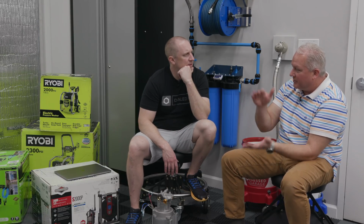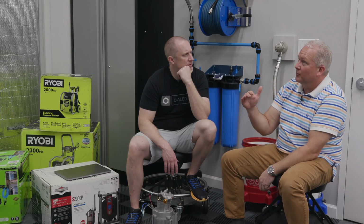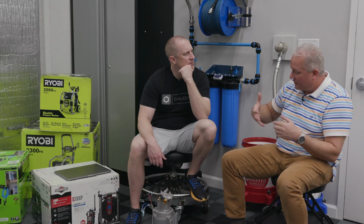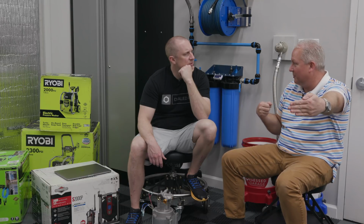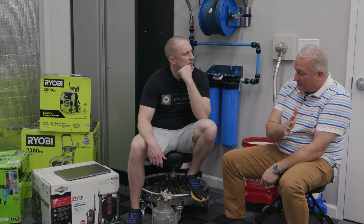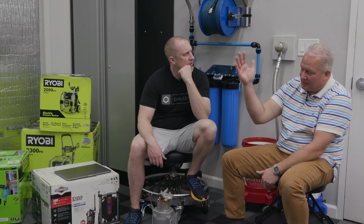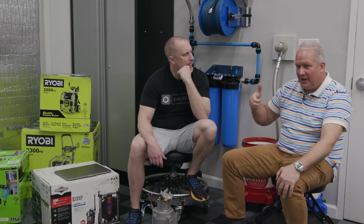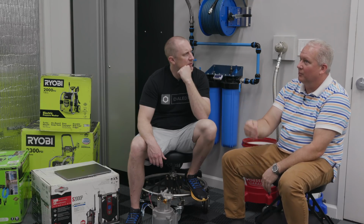UL has, I think, 3 stages, right? So anything that's under 500, over 500. I think the next one is over 3,600. And they require a certain length from where your hand is, where the trigger is, to where the water is discharging. So basically the nozzle, right? Okay. So again, most consumer grade pressure washers, between 500 PSI up to 3,000, 3,600 PSI, I believe it's 23.5 inches from where your hand is to where the discharge is. And then when you go over that 3,600, I believe it goes to 48 inches.